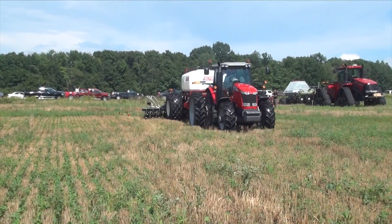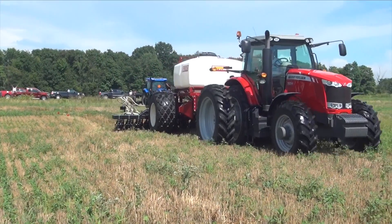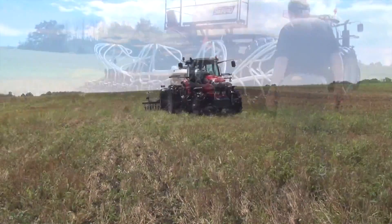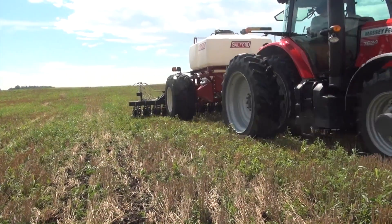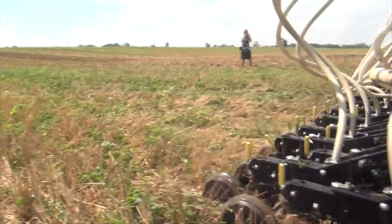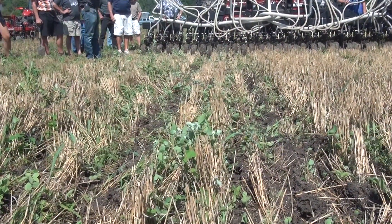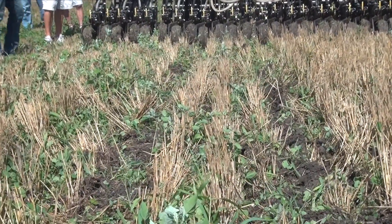This is a little bit of a different idea in terms of strip tillage. This is a seeder — just a drill, an air cart with a drill — and what we're going to try to do with this is bio strip till. We're not actually going to build a strip with the unit itself. Instead, we're going to plant different cover crop species in two of those units where the 30-inch corn row will go. It might be a daikon radish with nice deep roots to create a loose zone, and we might put cereal rye in between. It's the concept of bio strip till as opposed to doing it with the iron.